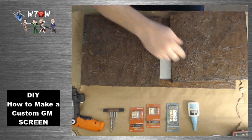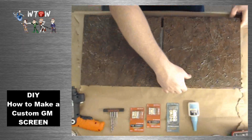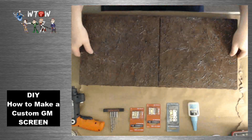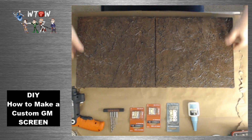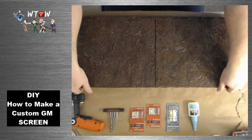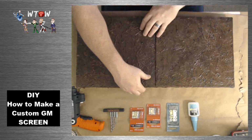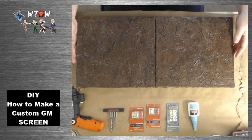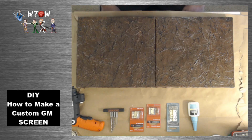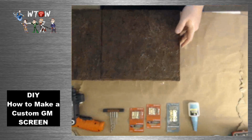Another option that you can do is on that interior lip of each of these panels. Again, you see it's nice and snug right there. Lines up great. But on the interior lip of each one of these panels, you can use a drill and tap out a small area and use some heavy-duty round magnets, and embed them in both sides of the small panels where they come together on that interior lip. And you could also do that where they would touch the main panel when they're closed. So that would give you a magnetic seal and a magnetic lock as well, besides just trying to use an external one.